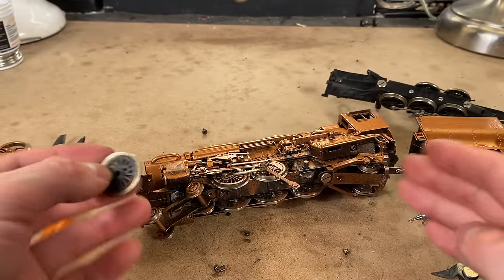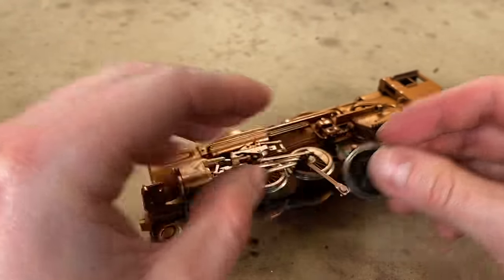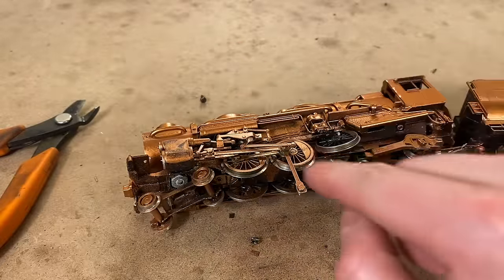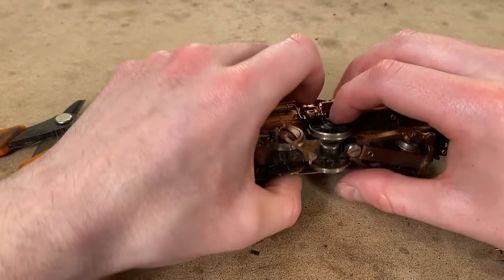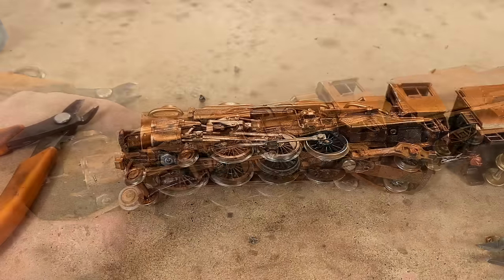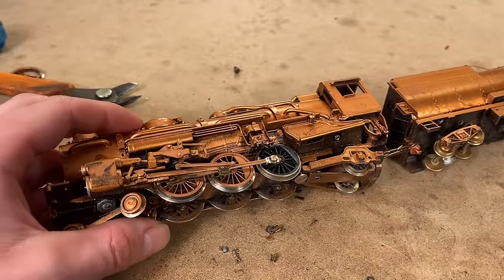I really don't like where this whole project has headed. So I just bored this out a little bit, so we'll try to get it into place. Now, this does matter because it will affect the quartering. Well, it looks about right to me. The bolt threaded in the existing hole pretty well, so we're just going to pretend that that's a self-tapper.